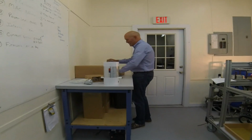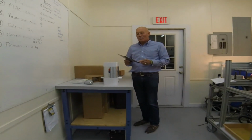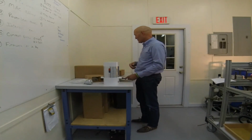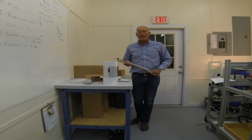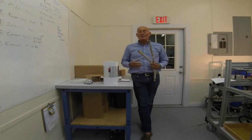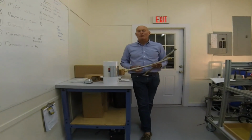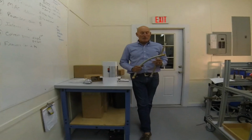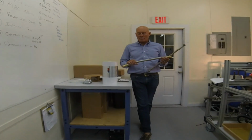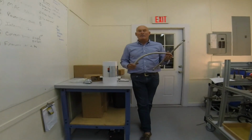And then we have the installation manual, which you can look at either in the box or online for the latest version. 2 things we recommend when you make the water connections are the appropriate size piping, but also the appropriate connections. If you are ever going to connect to any kind of plastic pipe, whether it's PVC or PEX or anything like that, you must use at least 18 inches of a metal or high temperature connection between the inlet and the outlet of the Model 1 and the water heating system.